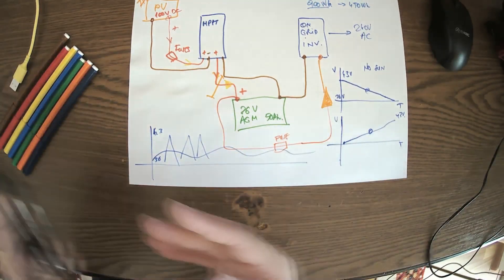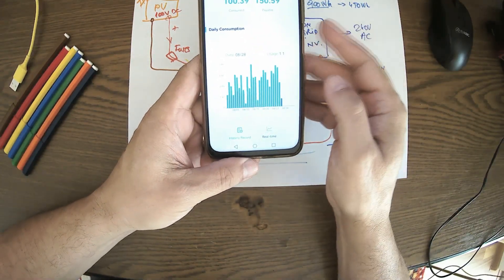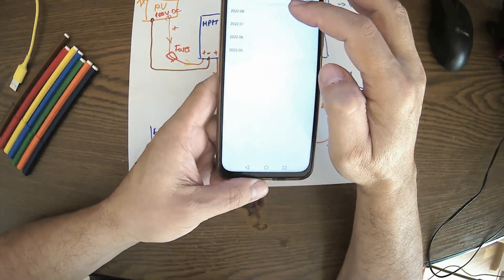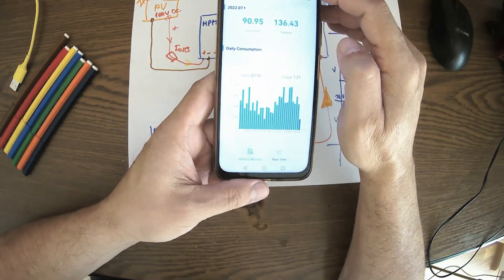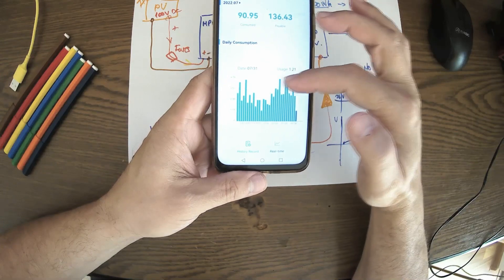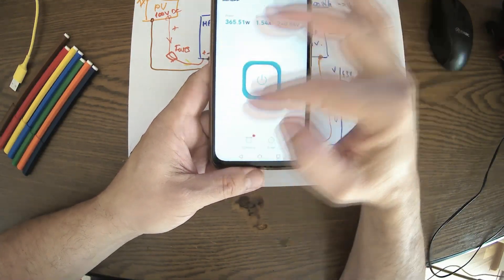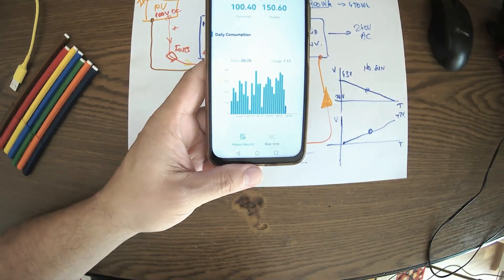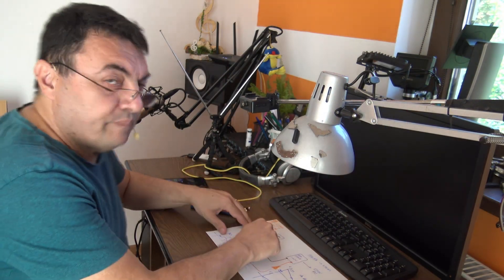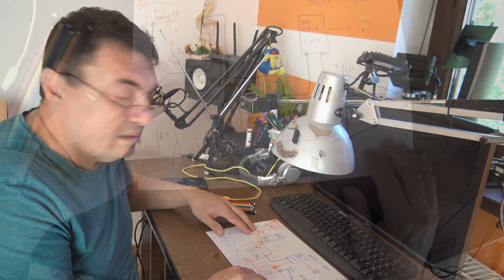Let me show you the production for this month — more than 100 kilowatt-hours. Today I only used 1.1 kWh; it's Sunday, not much happening. Looking at July, which was a very hot month with a lot of air conditioning use, I still reached peaks like 4.76 and a total of 19 kilowatt-hours. And in June, 51 kilowatt-hours. This configuration with the MPPT supplying the inverter and the batteries at the same time — the MPPT as the main energy delivery system — I think it's a great idea.